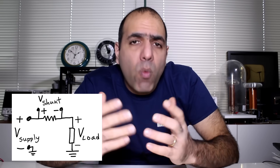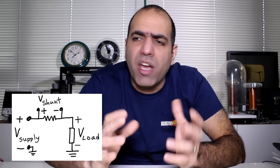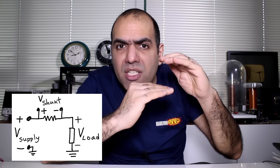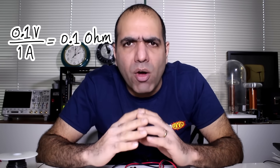And of course there are other standards too, like British standard wire gauge. Using a shunt resistor, you are generating a voltage drop that's not very desirable, because then you are dropping your supply voltage level by that much, which will affect the current running through the load. But if you keep that voltage drop small or compensate for it by increasing the supply voltage, then you are fine. I like to keep my shunt maximum voltage small — only 100 millivolts for a maximum of 1 amp, which means around 100 milliohms.